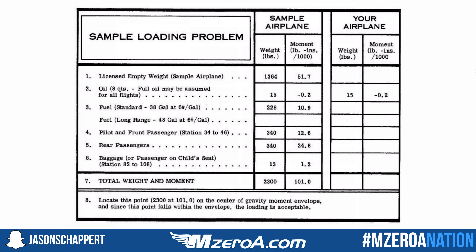We need to start with what's called our basic empty weight. Where you get that number is your actual weight and balance document. Remember the acronym AROW — Airworthiness, Registration, Owner's manual, and the W is Weight and balance. That is the actual weight and balance the mechanic provides to you. If you add new avionics or get the aircraft painted, you're supposed to get a new weight and balance. It would benefit you greatly to take a picture of it, because it needs to stay with the airplane.